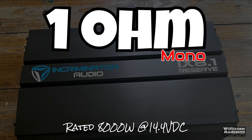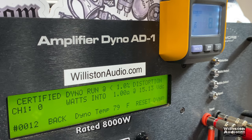Now let's talk 1 ohm. This is the big boy rating here: 8,000 watts at 14.4. Certified test first, at 1% THD. And right at it, again it jumped at the end, 7,964 at 14.46. I consider that a pass.